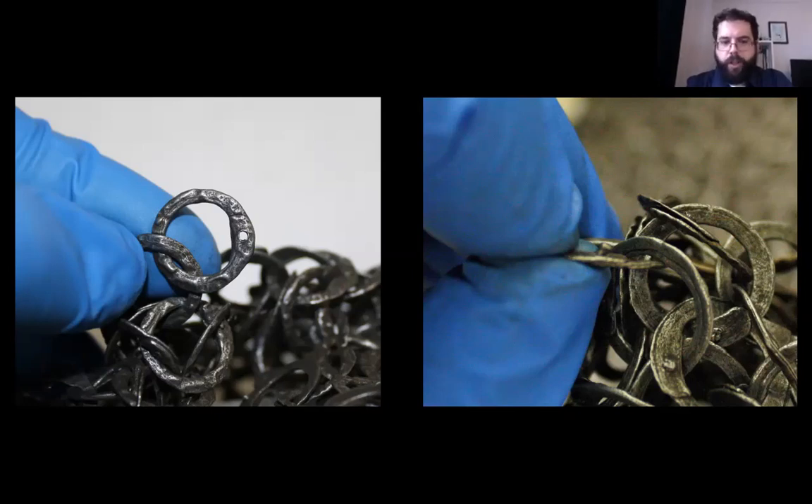This tells us that the depression in the jaws were larger than needed, giving the rivet room to bend over instead of properly compressing. It appears the oversized riveting tongs are responsible for the high number of losses and, as a result, the number of missing rings. The bent-over rivets would fall out or otherwise become dislodged, leaving the now unriveted ring susceptible to entanglement. I should point out there's no indication whatsoever that any of these losses were caused by a weapon during the shirt's working life.